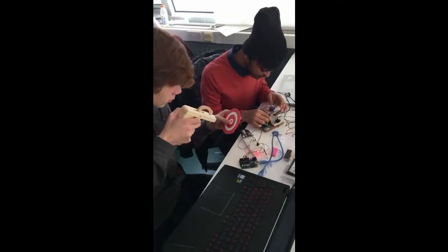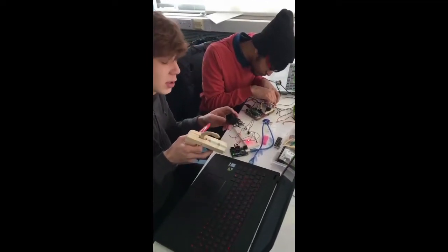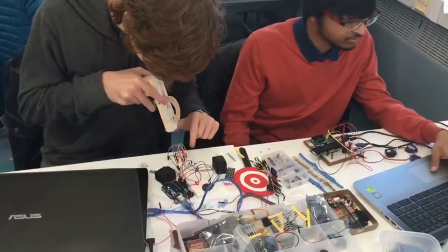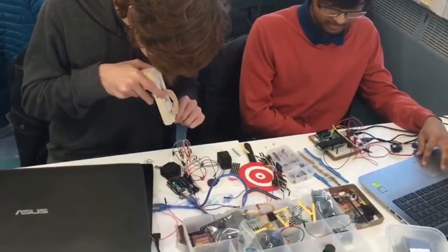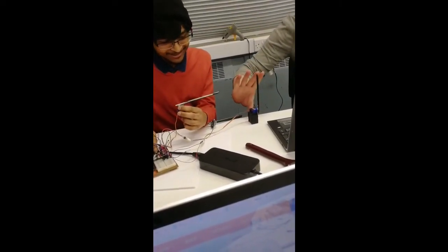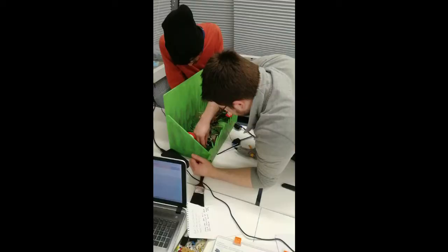Once this was assembled we had everything we needed to put the game together. The design process to create the program started with us creating a list of requirements. From this we created circuit designs to ensure that the Arduino would not blow a fuse when drawing a large current. We were going to need three moving targets and therefore required three servos, which were connected to an external power source, only keeping the digital pins connected to the Arduino to control the servos.